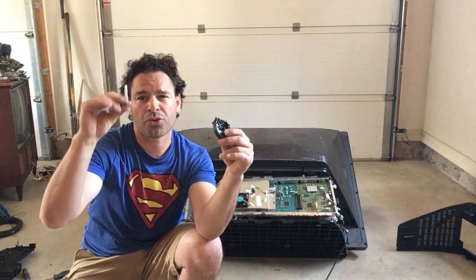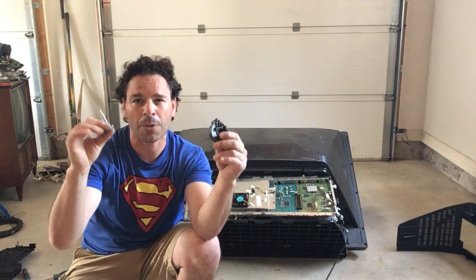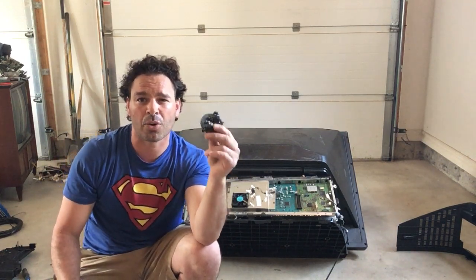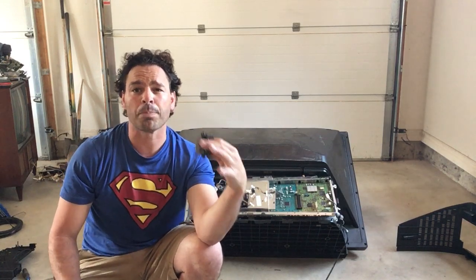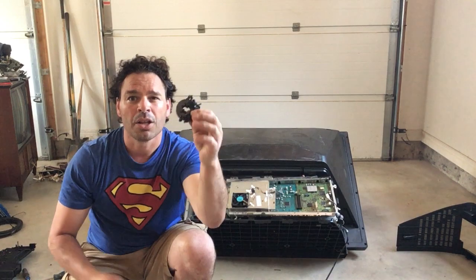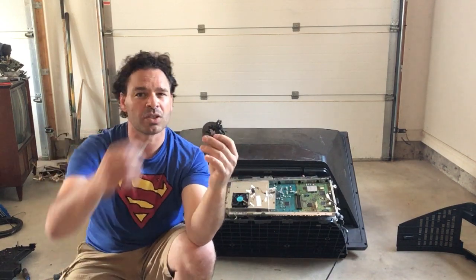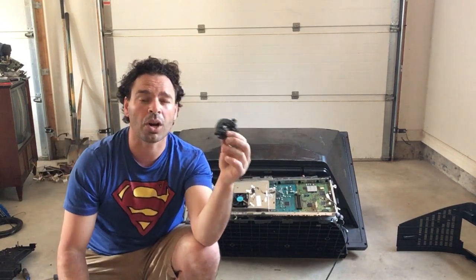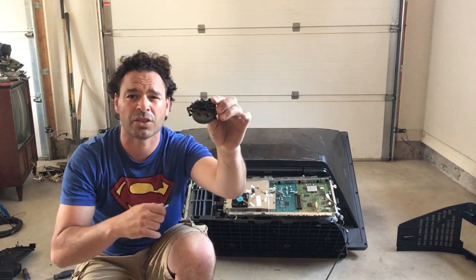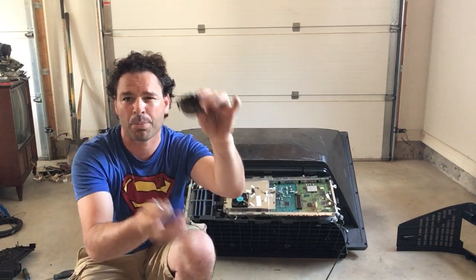You do want to check thickness — some are steel. Check your nuts and bolts too, because some are made of brass. If they don't stick to a magnet and reveal a gold color when scratched, they're definitely brass. But I throw them all in one bucket and bring them in as tin shred.